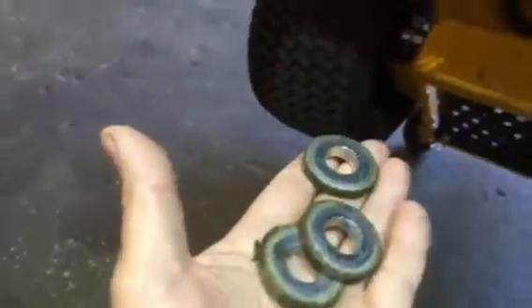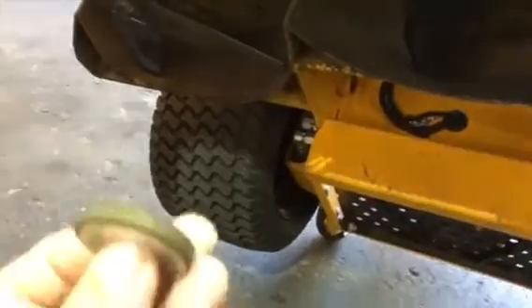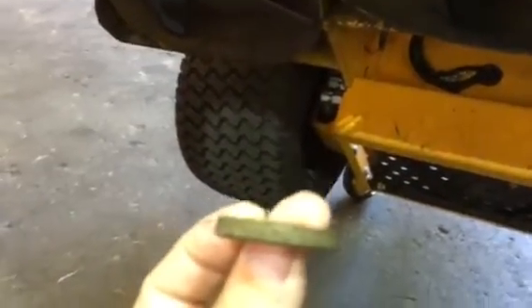Let's raise it up a little higher so we get an idea of how it looks. We got a good close-up here. What the technician did is he took one spacer out in order to keep it at the same height, so the thickness of the blade and the adapter is equivalent to one quarter of an inch. The height of cut will stay the same, but if you were to put the two spacers back in, then it would be one quarter of an inch lower.